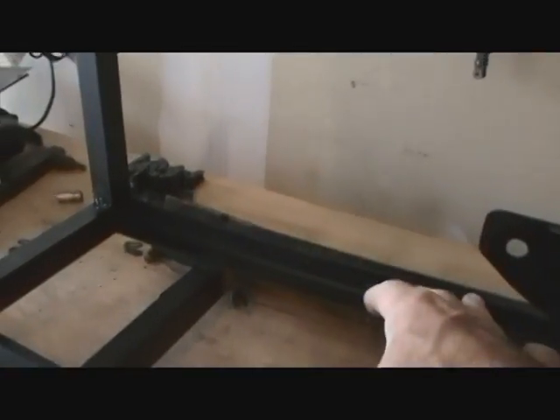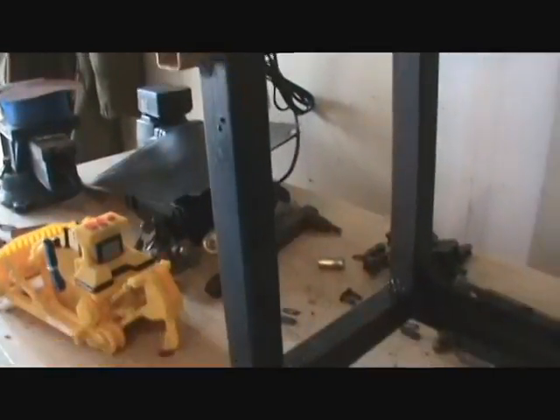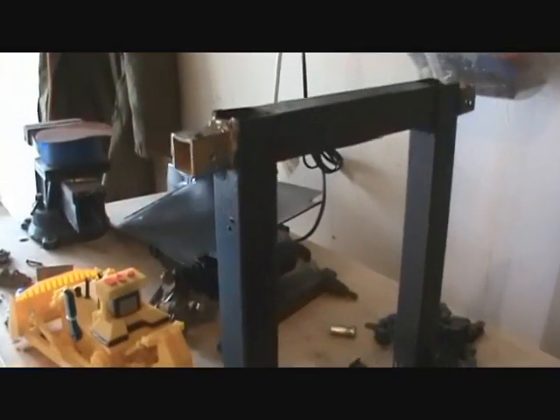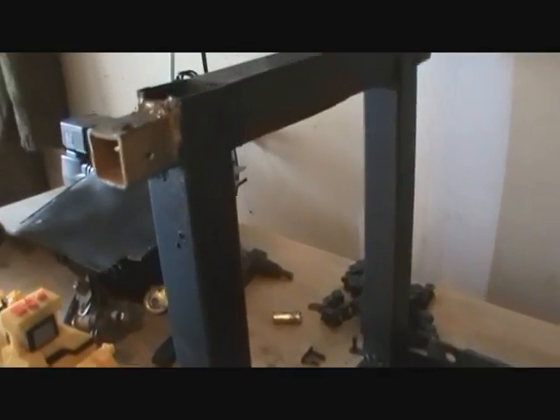Now that you've got these pieces — your base down — you've got to figure out how high to build this piece here. What I did was, I had the battery in here and that gave me what my height was. I used the one inch by one inch square tubing and welded it all together. You probably could use smaller stock — I think there's like a half inch by half inch tubing and that would work as well.